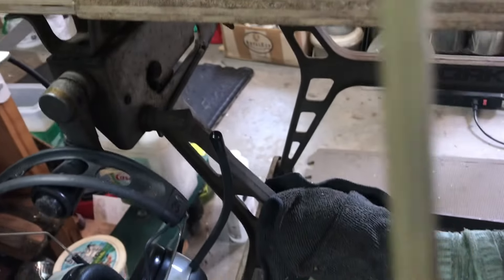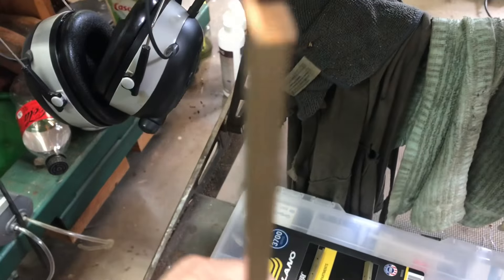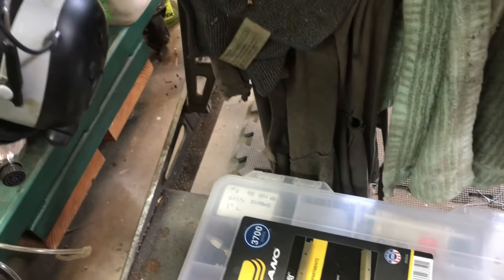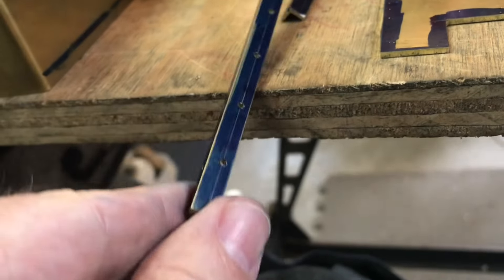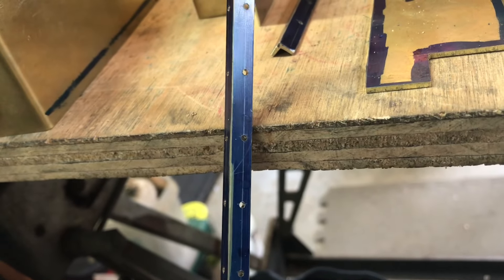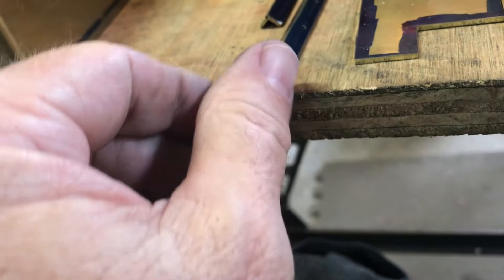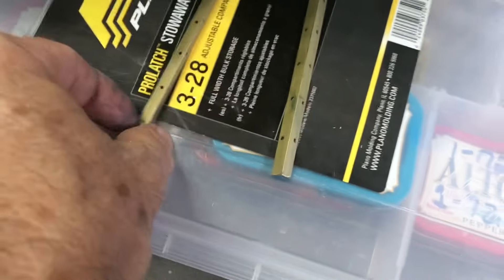Here's the 1/16th inch thick brass angle stock that I got from Online Metals — I bought two three-foot pieces. It's really nice stuff, drills really well, and it's nice and square. I outlined it about 90 thou down from the top, laid out the holes, and drilled tapping-size holes for 1-72 screws. I've done that on both sets of angle that'll go in the bottom of the tanks.